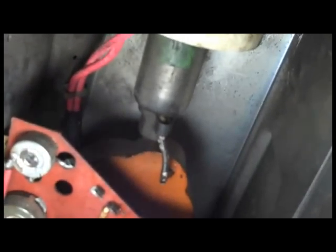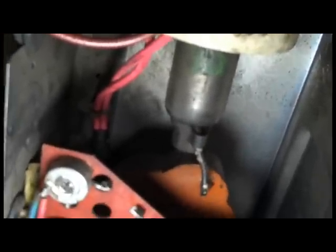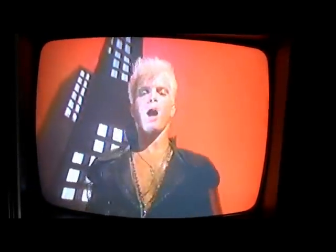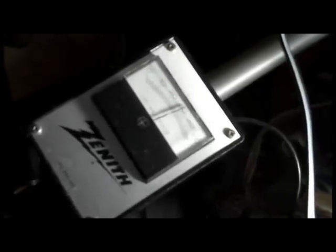We're all back together with the new high voltage rectifier filament leads, and even the cigarette-flavored rectifier tube back in there. We have good high voltage. Going to seal it all up and see what kind of picture we get. Very stable, back working the way it was — full deflection on all four sides, good color. My high voltage is right on now with good regulation. I can go from about 32 kilovolts down to 20 kilovolts with the high voltage adjustment, and I've set it at about 24, right about in the middle.